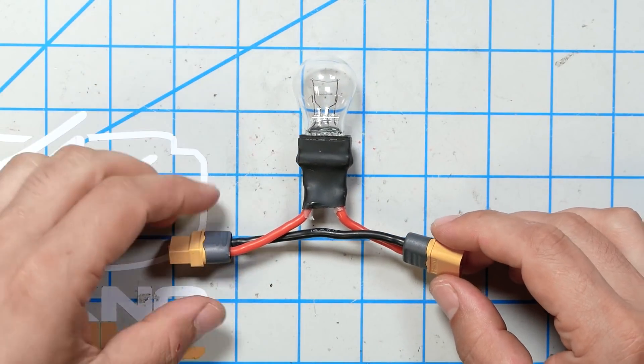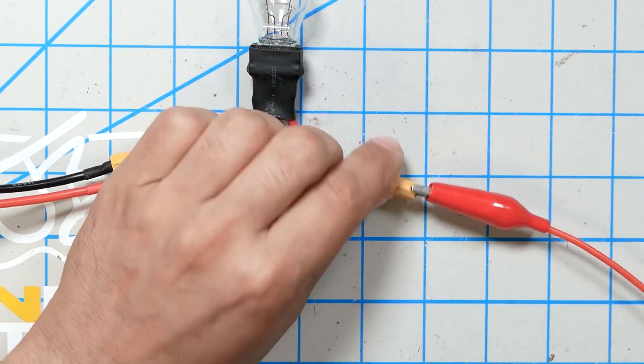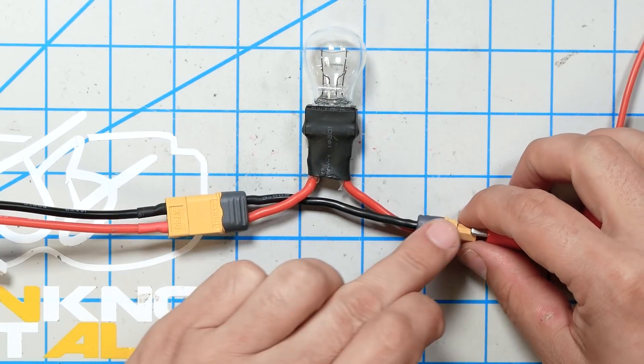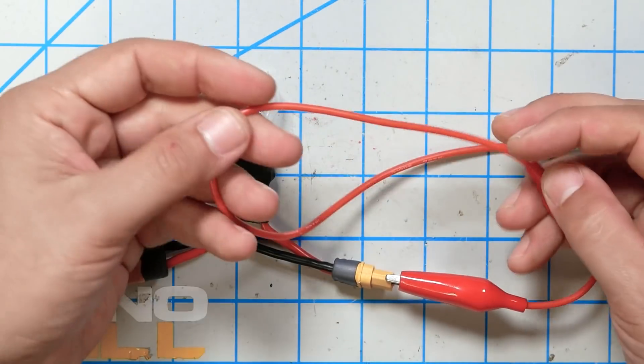This is an automotive taillight bulb. When you plug a battery into it and short circuit the terminals, the bulb lights up — it's very bright. When you've got a light bulb, the purpose here is to provide resistance that prevents a short circuit from causing damage. Normally, this wire would be some part of your quadcopter that you accidentally short circuited with a solder blob, or maybe soldered up wrong, and it would fry. But with a smoke stopper bulb in line, the bulb prevents the current from flowing and lights up as a convenient visual indicator that you have a problem.